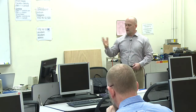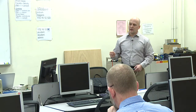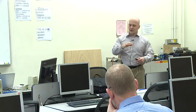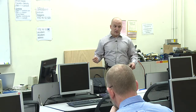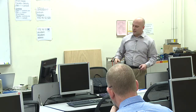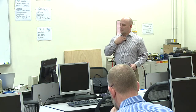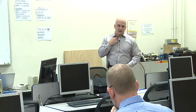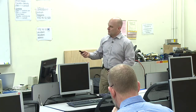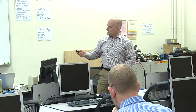And so when we get into the software, you'll see you have a selection of zero. It's a little bit different in the Sedona platform. They call it a 0 to 20 milliamp. They mean 4 to 20 milliamp, but the guys who set this up really are not HVAC guys, so there's a little quirky stuff there. So you'll select a 0 to 20 milliamp scale, right? Really, it's a 1 to 5 volt DC. Honestly, that's what the controller sees. But that's what you'll select when we set up the software for this, okay? Okay, so the receiver component, like we talked about, receives that BAS signal.